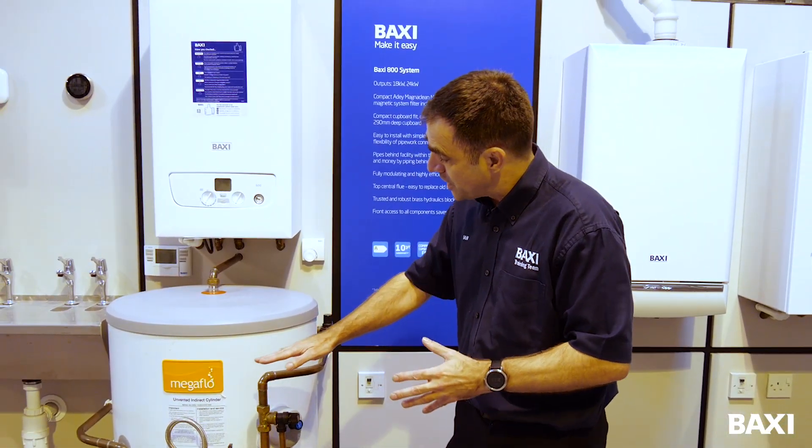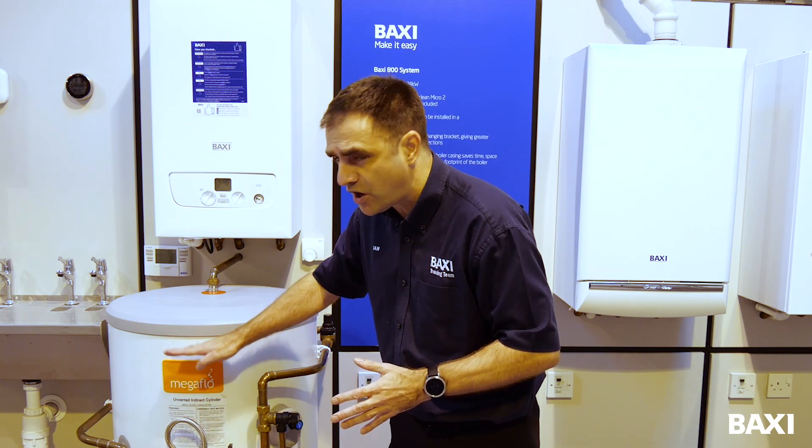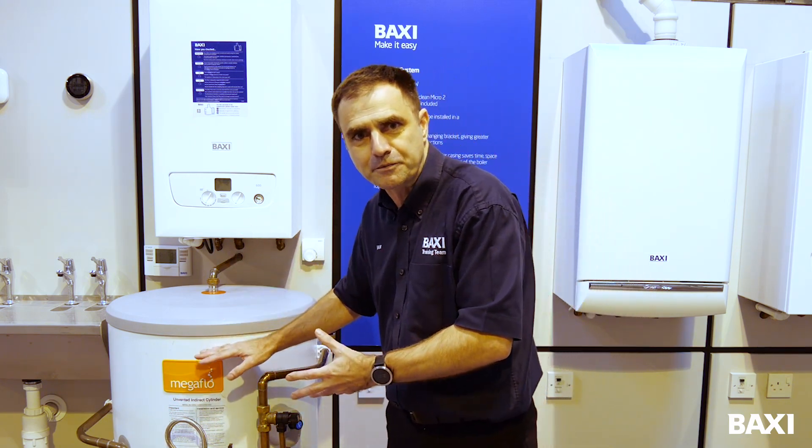You might get a little bit of water dripping out of there. That indicates that the air pocket that sits inside this cylinder has been depleted — it's gone — and you're going to need to put it back.